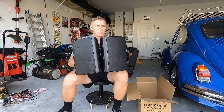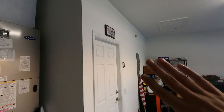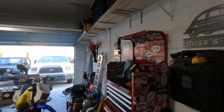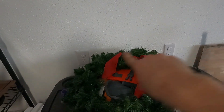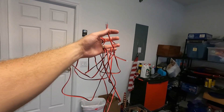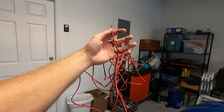I'm going to give you a quick demo of how to set these up here in my garage. One of the first things you're going to want to do is figure out where in your space — or in my case, your garage — you want to mount your speakers. I have a plug right here and two more outlets right here, so I decided to put one speaker close to the outlet with the other speaker directly above the door. The provided speaker wire is about 16 feet, so you have to make sure it's going to reach for the spaces where you want to put your speakers.